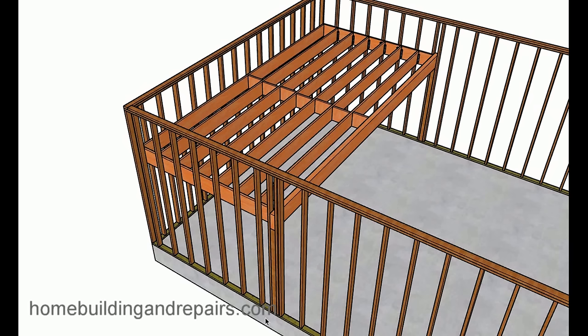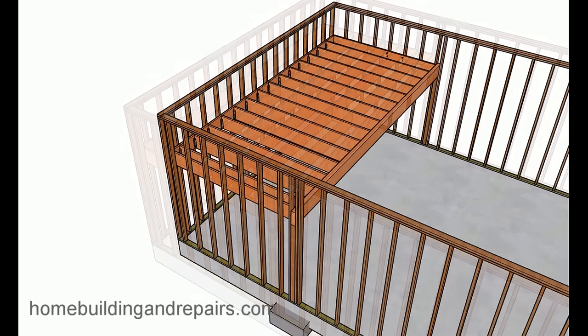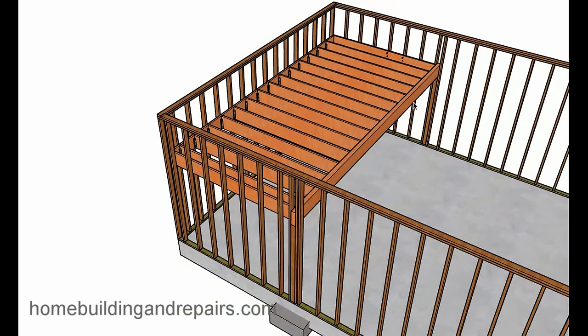I can't give you any recommendations for strengthening the footings for something like this — that would be something you'd need to check with an engineer on. But if your footings are strong enough, something like this would definitely work. The next step will be to have a beam that will support the joists. The wall and footings — you'll have the wall here and then the beam, and this will be transferring the load of the floor to each post and then down to the footings, which you would probably need to install a footing for this type of design.